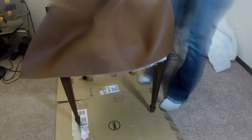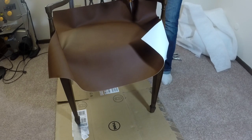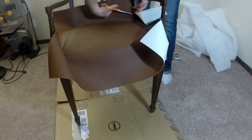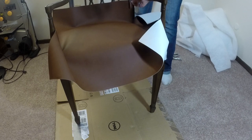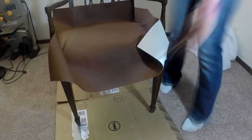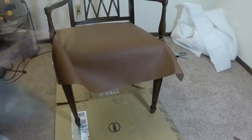The upholstery we took off was super stiff canvas, but we're using vinyl with a little bit of give, so I made it a little bigger so we could stretch it under — because with people sitting on it, it's going to give and crack if it's not pulled nice and tight. She's cutting a little slit slightly bigger than the posts on top of the legs. Since it's stretchy material she can compensate for mistakes. Her rule of thumb: cut small, then go back and cut a little bit more until it fits — you don't have to be precise the first time.